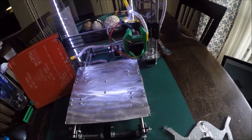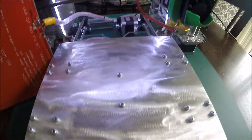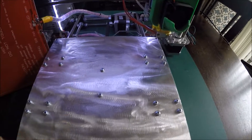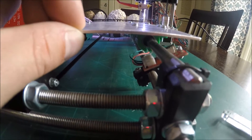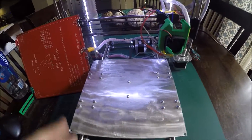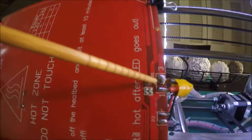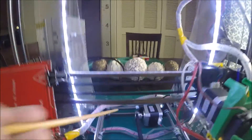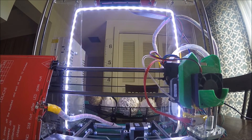This aluminum plate has four mounts. Lots of measuring — I drew it all out before I built it. I used millimeters since my caliper is metric, not standard. I chamfered some of the holes so the screws wouldn't get stuck, and all the screws went in pretty well — everything lined up perfect. I used a drill press to make sure everything was straight. It's super firm now, no flex at all — super stable. Everything's nice and parallel, it slides in and out very well. I did a brushed surface on it to reflect all the heat up toward the bed. No issues with warping.